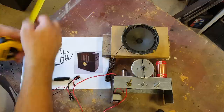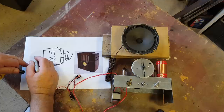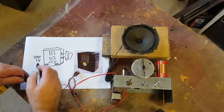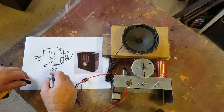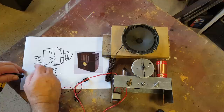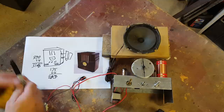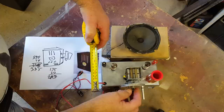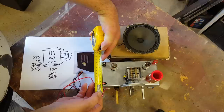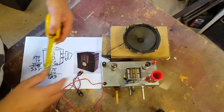I've laid it all out. A speaker I think will be about that size. To fit everything in there it needs to be about 275 mm high, so to give myself some room I'll make it 290, then add 24 mm for the timber on top and bottom. The width is 175 mm plus 24 mm for the thickness of the timber — let's make it 200. So that'll be 335 mm high by 200 mm wide. For depth I'll need 110 mm at least. I've got a sheet of 9 mm MDF for the entire case — fairly light — and I'll start cutting pieces.